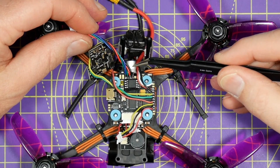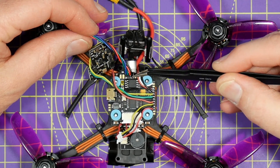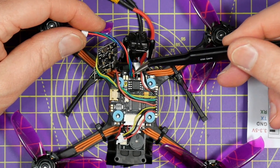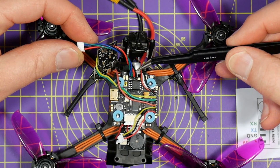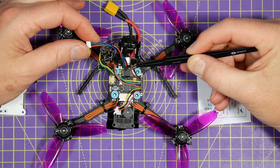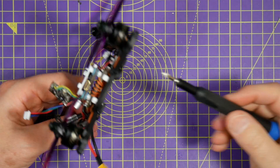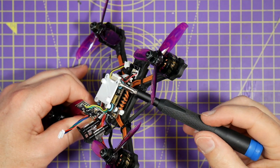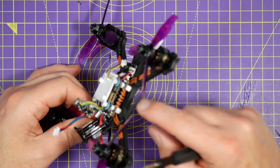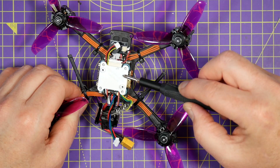There's a capacitor between 5V and ground on the Mamba 405 flight controller board. I've connected the power and ground to those two pins, and then we've got the RX and TX. Remember to double-check your wiring. As usual when you've finished any soldering, it's always a good idea to use your multimeter and do a continuity check to make sure you haven't got any shorts between power and any of the solder connections. This is a soft mount stack, so don't screw the bolts in all the way and really tight because you'll squish down the silicon mounts. These are screwing into plastic so they're not going to come undone very easily - you don't need thread lock.